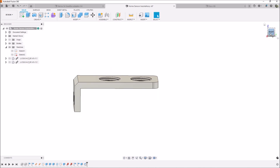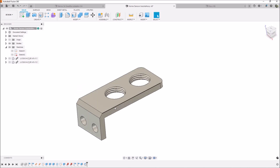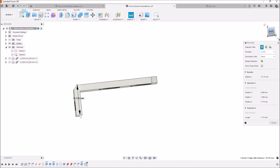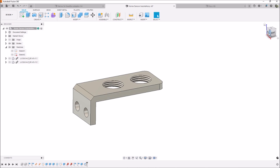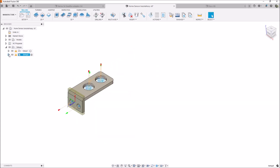This bracket I just made from some scrap aluminum angle that I had laying around and manually machined it to size. The width here is 20 millimeters by about 45 millimeters, and this section here is about 15 millimeters. I just took this from the bracket we had and made it a little bit longer to accommodate the extra sensor.